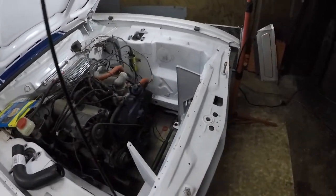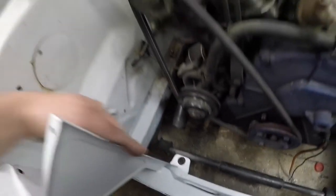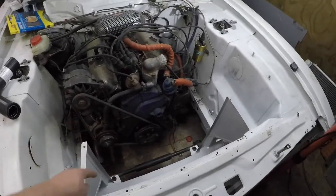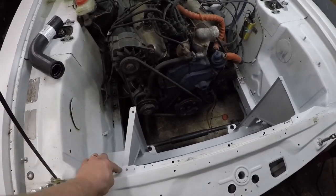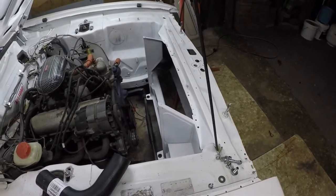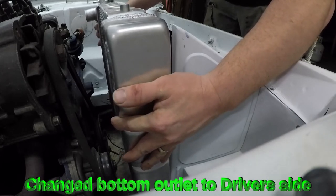This is it without the radiator in so you can see what I did down the bottom — tabs and grommets, and these are the folded-up bits of metal. The strip here is just for a bit of foam weather strip to go on; that'll seal it up. I might get some thinner three-millimeter stuff for here. I'll show you how it all goes together now — we'll go get the radiator and drop it in the hole. This is the radiator with the modified inlets and outlets to suit.